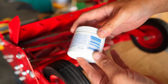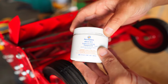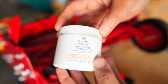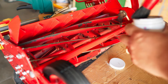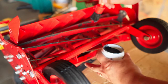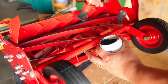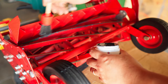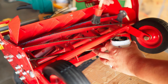I don't have lapping compound, but I did pick up this valve grinding compound from Napa Auto Parts for under 8 bucks, and I believe it's about 120 grit. I don't need to take that much off, so this should work just fine. I'm just going to brush this on to get it going. Not really trying to make it even since the centrifugal force when the reel is spinning will force the compound to the cutting edge. I'm going to throw a bunch more on it as it's spinning, so it's going to get a bit dirty.